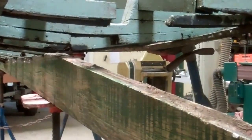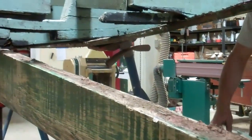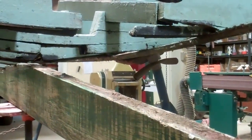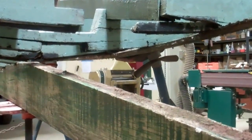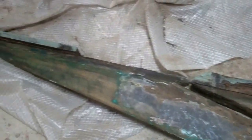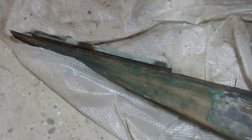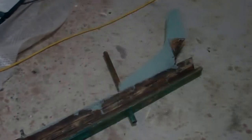Well, that's the report for the first day of winter. We've ordered some eight quarter kiln dried white oak FAS grade that we will laminate so that we can get to the proper thickness. By laminating it, we'll be able to run grain two different directions, and that will give us a much stronger result than we have at present. The deconstruction is just about complete, and from this point forward, Roxanne will start having her parts put back together. Talk to you soon. Bye-bye.